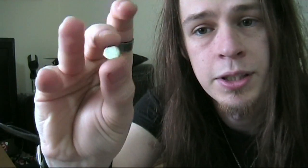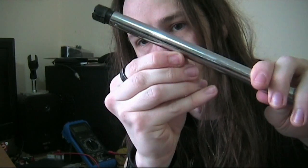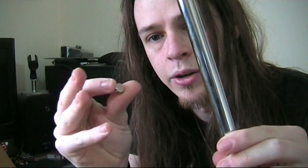What I've got here is a neodymium rare earth magnet. These particular ones I use for charging the pole pieces on single coil pickups because they come unmagnetised, so you need to magnetise them with a strong magnet. These are very powerful magnets. You'll see that when I bring them into contact with something made of steel, they're stuck and it takes quite a bit of force to get them back off again.